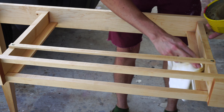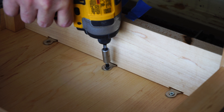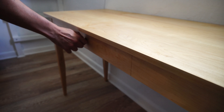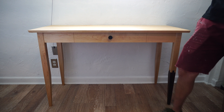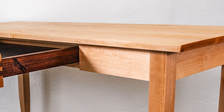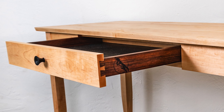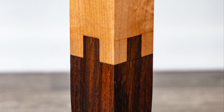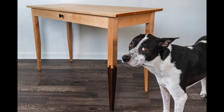To assist with the drawer movement along the runners, the drawer sides and runners get a pretty heavy dose of paste wax to allow for a smoother glide. The top is mounted via the figure-8 fasteners and we're done. This desk, while deceptively simple, is chock full of detail and technique. I'm pretty thrilled with the final product and candidly keep finding myself rubbing on that glassy hand-plane surface. I'll be spending a lot of time at this desk editing videos and doing computer work, so it's nice to have something classic and timeless to work at. Also, based on its small size, it can eventually transition to an entry table should the need arise. While this is not a pure Shaker writing desk by any stretch, the principles behind the craftsmanship are quite the same. In the words of Christian Becksvoort: joy is in the details that make a difference. Thanks for watching, and as always, see you next time here at Cowdog Craftworks.